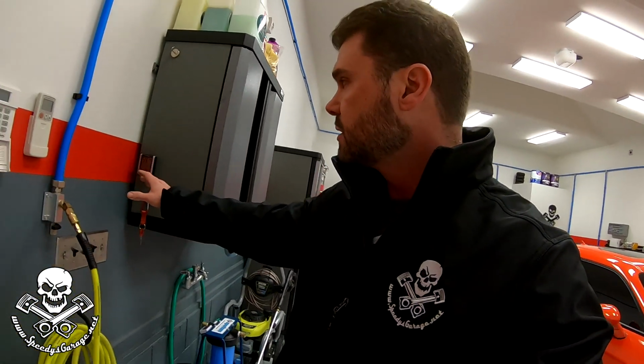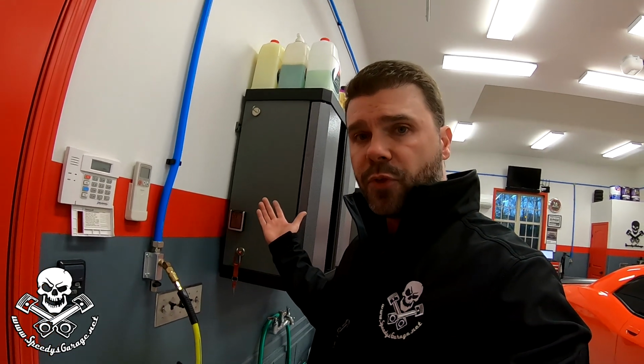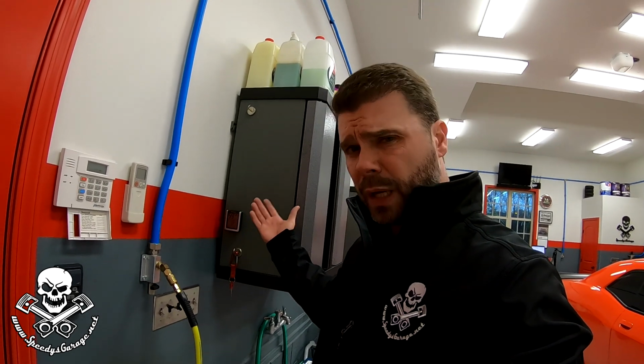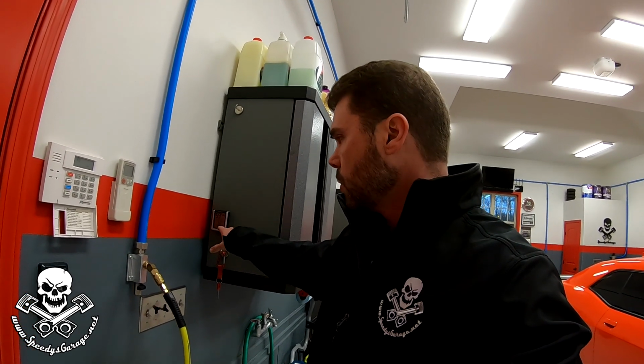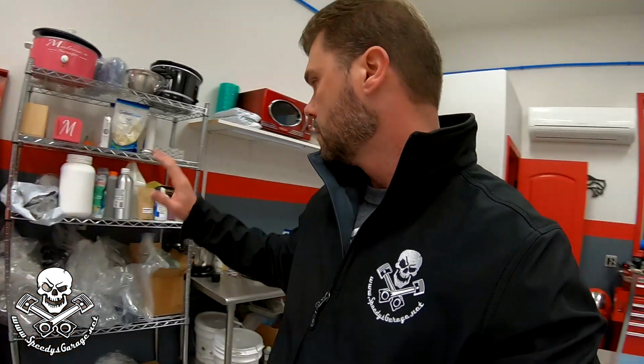So for example, it's been really cold the past few days, and we've talked about the thickness of the wall and the 6-inch studs. And you can see now it's 52 degrees in here. And the high might have been 30 today, maybe 35. It's been cloudy and rainy, so there hasn't been any sun. So the shop will stay, I think the coldest I've ever seen it get in here is about 42 degrees maybe, and that was on really several nights of cold weather. And so that extra insulation is paying off, and we'll talk about that in the future. But that was what I was thinking about for the water and the plumbing. And so spigot, PEX, shutoffs. So keep that in mind when you're putting yours in.